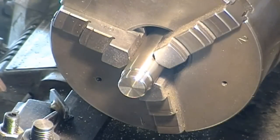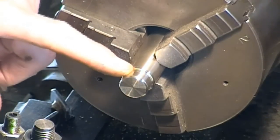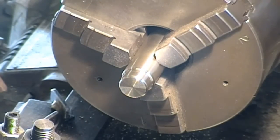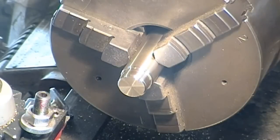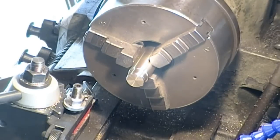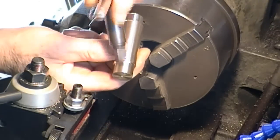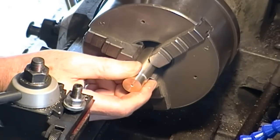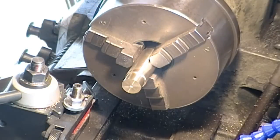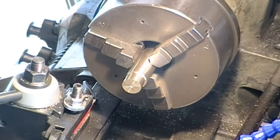I've just done those edges - I didn't video whilst I was doing it because the tool post sort of got in the way. So we've got our chamfer here and a chamfer there, and we'll turn it around and face the other end off to get rid of the center hole, do the same thing. This end we're going to reduce down hopefully to about the half inch we've got on there. I didn't use any packing on here - I've got some slight chuck marks on the brass, so I'm not worrying about that at the moment.